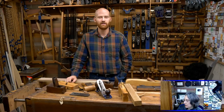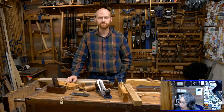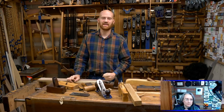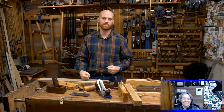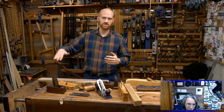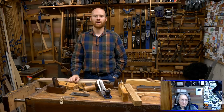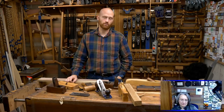Luke K picked up some auger bits with round shanks instead of square — how well do they work with braces? It depends on how much force you can crank down. They can work, but with a larger bit like three-quarter or one-inch you're probably going to end up sliding — no amount of twisting will lock them down in a brace. What happened is a lot of people who got rid of their braces cut the square taper off and put the bit into a chuck-type tool where you can crank down on it and apply a lot of pressure. For a brace you can't get enough force on the big ones unless you have a very strong hand.